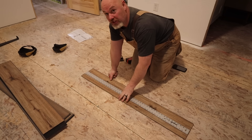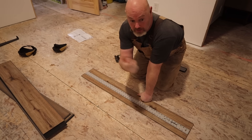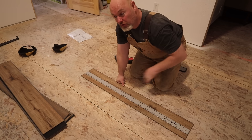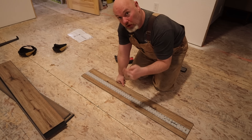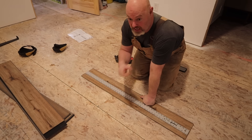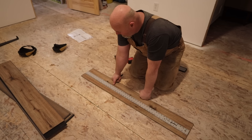Each of these planks is seven inches wide — that's the actual coverage it's going to show. I measured from side to side and lengthwise and figured out how the floor is going to lay. From side to side it's going to take 22 and a half rows. So instead of having a half plank on one side and a full plank on the other, I'm going to take a quarter off each side — three-quarter plank on each side — and center the floor. I did the same end to end and it came out to 3.8, so I'll take a little bit off each end plank and center the floor.